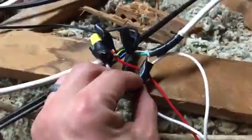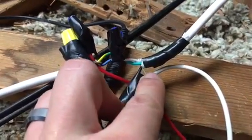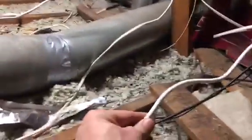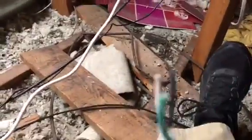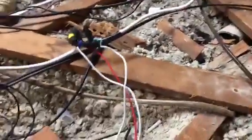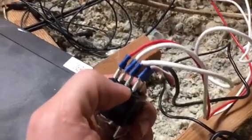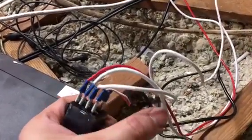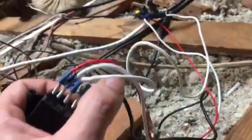All right, so this next wire, when I wired these two wires together without the switch, I'll follow the wire for you. It goes into your black, your hot wire, which is coming out of the power, right? So remember, from your power, you're going to have 3 wires inside of this wire here, and it looks like this. So this black wire right here, that's your hot. That is getting plugged into this second one up right here. And again, I know it's a little confusing because I connected it using a white wire. I don't remember why I did that, but I used a white wire.